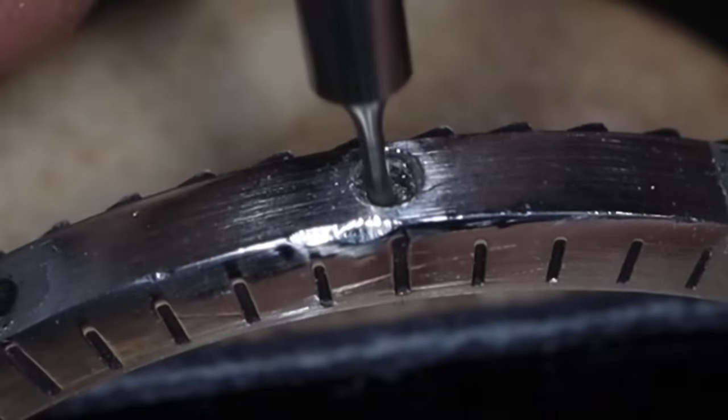I also have these very handsome looking rotors, and as you can see, our rotor looks quite sad and sorry. The rhodium plating on the oscillating weight has faded, but I'll try and restore this just to keep as many original parts as possible. There's the eccentric, and here are some of the oils that I will be using.